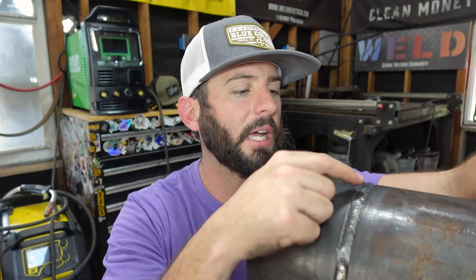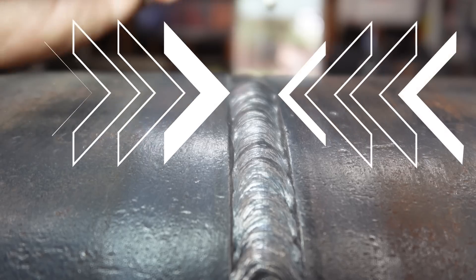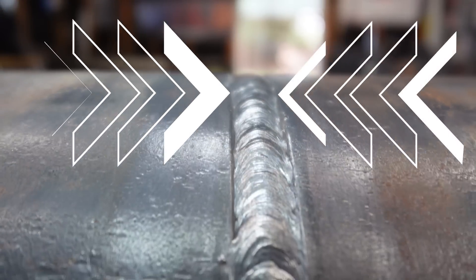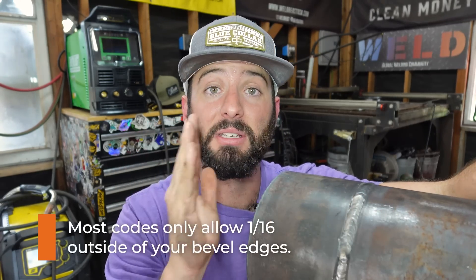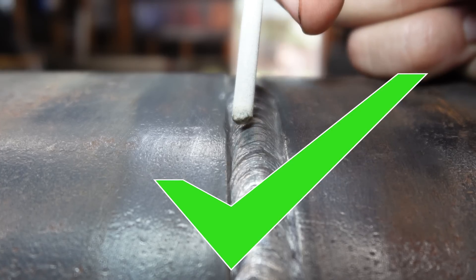When we start getting out to the next fill, we can see how much it actually fills up with the next bead. We've got to compensate for that, and if we start getting to some high spots that's fine to leave them until we're ready to cap — then we need to knock those down. The trick is staying inside these bevel edges. We do not need to get that rod going outside those bevel edges; otherwise you're widening your bevels and this is not the point to do it. Even after the cap you're only allowed to be outside the bevel edges about a 16th of an inch on either side.